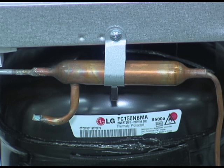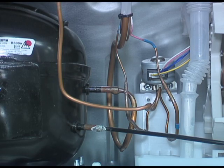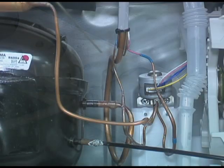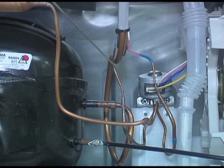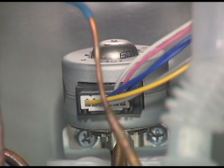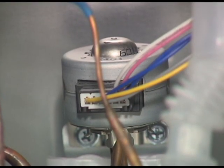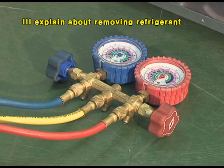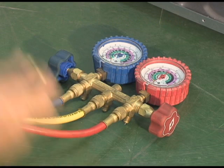Preparation before removing refrigerant: for the evaporator model, method of opening both sides of the three-way valve. If the refrigerator is an evaporator model, plug in for 20 seconds so the three-way valve opens both the freezer capillary tube and the refrigerator capillary tube. Unplug power after 20 seconds.